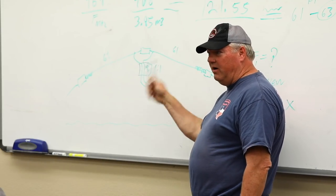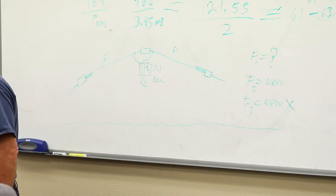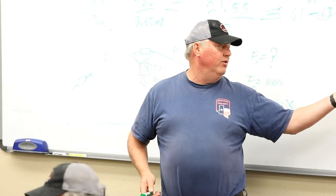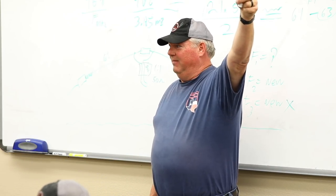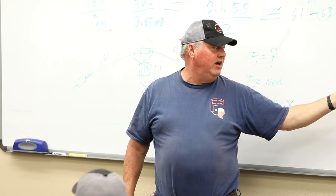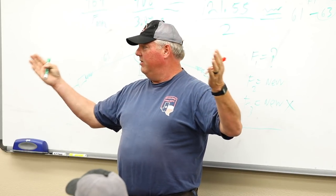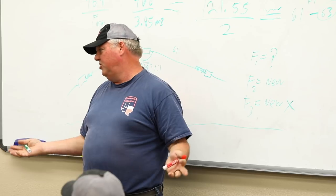Did it help anybody just talking about it? On these connectors, it's like you're talking about a tree. Now you want to put a rope on each one of these and pull it. Absolutely. That's a great question. Once you look at your little diagram, the insulators on the end, what's not good to do is to run right up to your metal frame on your aluminum building, screw your insulator to it, and then run your antenna right off that. Too close. Yeah. It's way too close. So what you want to do is put an eye hook on there. Hook your insulated Dacron rope, come out a distance that will work for you, hook it to the side of that, and you leave a little extra. That way when you're tuning your antenna in and out, and you go, yay, I've reached resonance at the frequency I want, and my bandwidth is good, then you go out and secure everything.